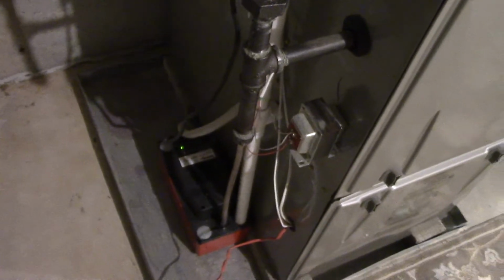And soon you should see water coming out of the drain tube right here. And I'll also take this cover off so you can see the little spout of water inside. Let's see. And it takes a little time. Oh, there it is. It's starting to drip now. Yep, there it goes. And water's going out of here now, right into the condensate pump, so that's where it collects.